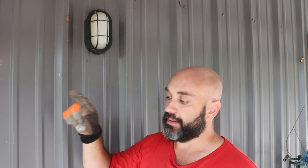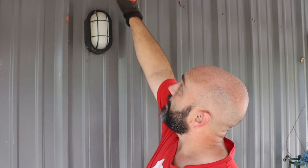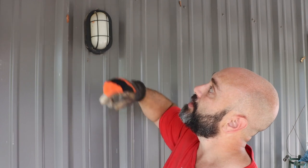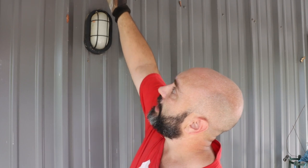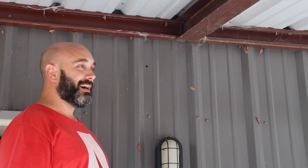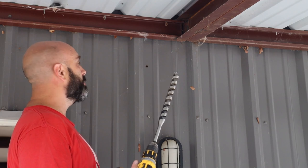I think I'm going to listen to my wife and not go in where the bathroom might be, just out of an abundance of caution. I thought about putting it above the door but I don't know how that will affect passage in the future. I want to stay away from the high voltage, so I'm going to stay at least eight inches or more away. Where two of the red iron beams meet I don't want to cross that — I want to lay it in the tray and come right down without crossing anything. I'll aim just slightly left of this light fixture. I must have misplaced my drill bit for one inch, but I do have a one-inch auger bit so we'll try that.